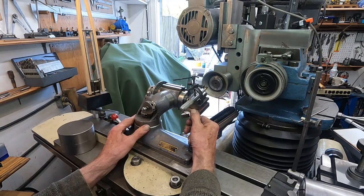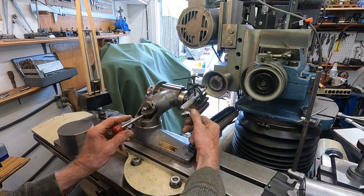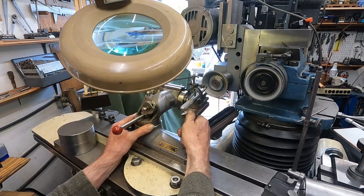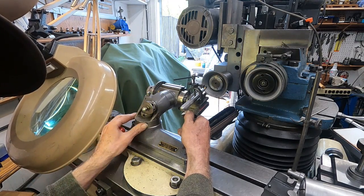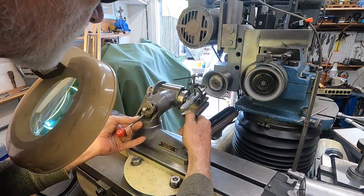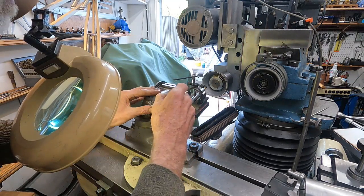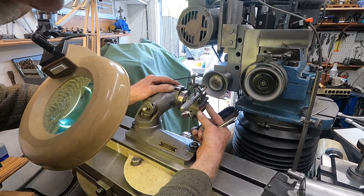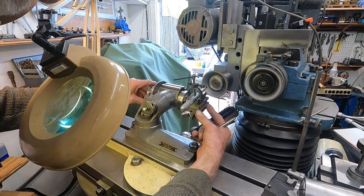And I'm going to set this at 90 here. Lock it down. Let's see. I got to put some better light on it there to see those little marks. I even got a magnifier here. That's just absolutely helpful. Right on it with the magnifier. Now, if I don't move it, this thing's really quite a quality thing, and it doesn't really move when you turn the locks. Okay, that one's locked. This one's locked at 0. It's all tight. I've got a Starrett combination V-block with the tail screwed to it in a 1-inch collet in the All Tool Rotadex.